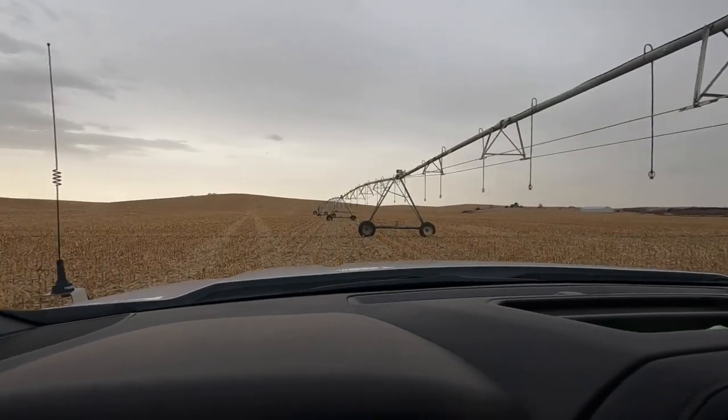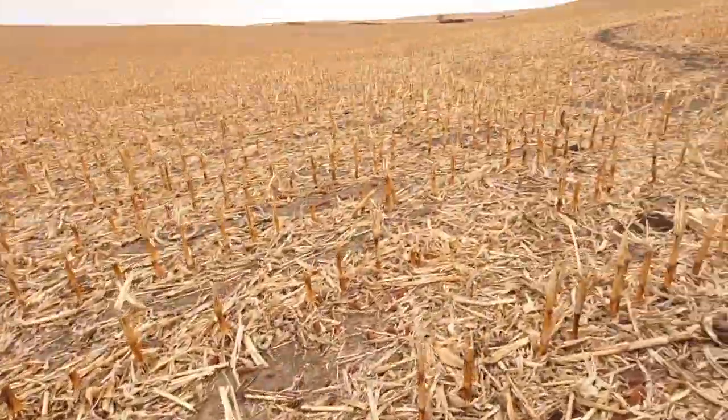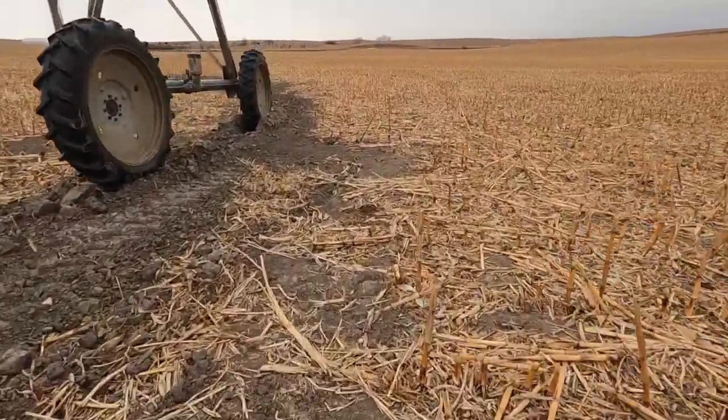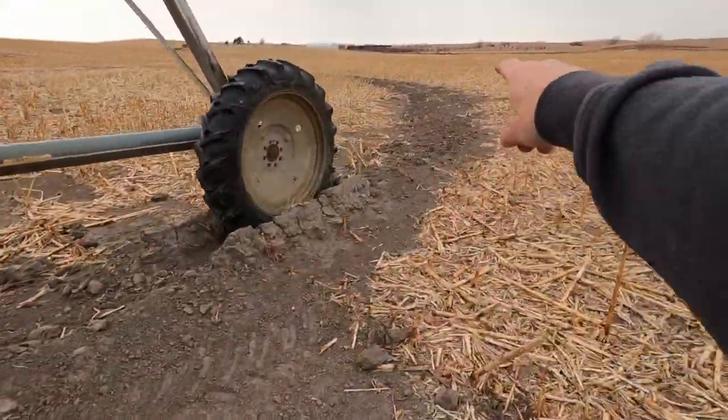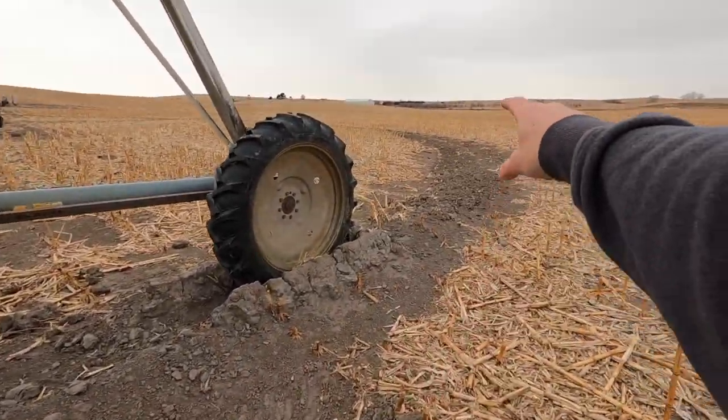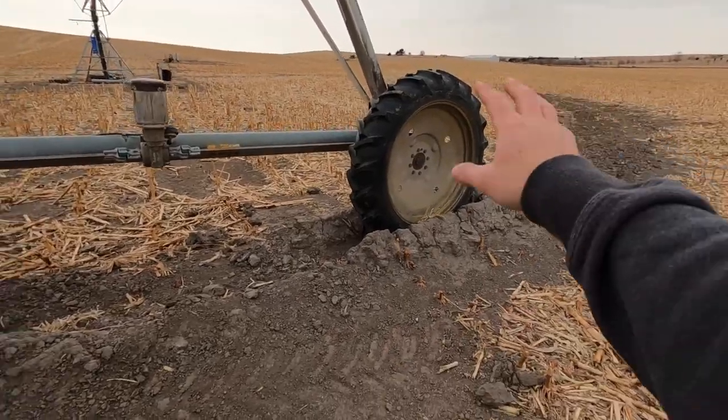I might run through the rest of these towers to see if there's anything else I need to bring out. You see this mound right here that builds up where the tires were — before this one had tall tires, it had short tires, and those short tires weren't able to climb over the silt that built up and would just keep shoving it into a pile. Since I put the tall tires on, it tends to do that on some of these first towers. Those tall tires will do a better job climbing over that stuff and shoving it out of the tracks, whereas shorter tires will push it further — kind of a double whammy.